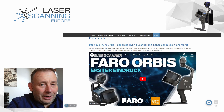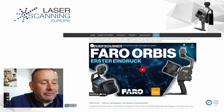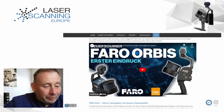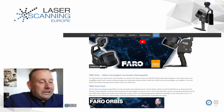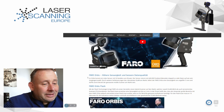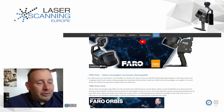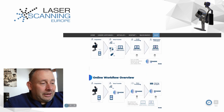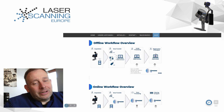For all people who are new: I have a link here on our website for the Faro Orbis Scanner and I think we also have a video there. It is the new SLAM Scanner from Faro — they brought it out a few months ago. It is the first hybrid scanner: it captures using SLAM scanner technology but you also have the option to do static scans and colorize them. My workflow is capturing with the app, transferring via Wi-Fi to my local Connect software, then doing SLAM processing in Connect — but I haven't done any registration to external reference points yet.